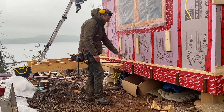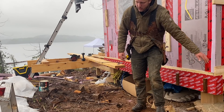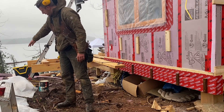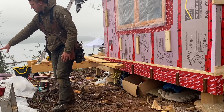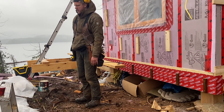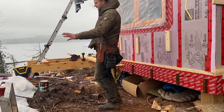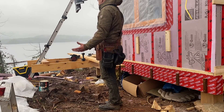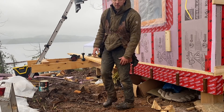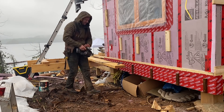I'm squaring up my end and cutting the rim joist about four inches short so I can put a four-by-eight on the end and run that out 16 feet. I'm trying to create a deck that comes here and then wraps around this big rock, because I want to build a fire pit on top of the rock and have the decking scribe around it — so we can sit up here at the high point on the property, have a nice fire on a flat deck, and look out at the unfiltered majesty. Just framing a deck — pretty straightforward.